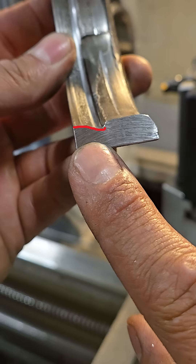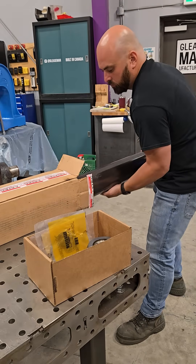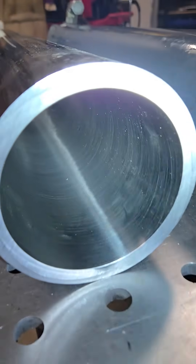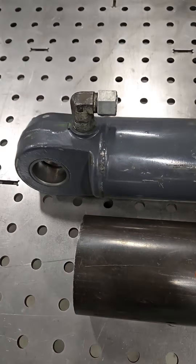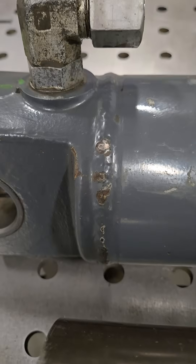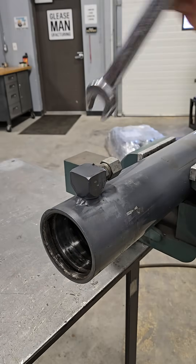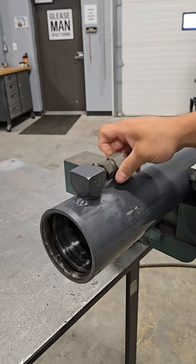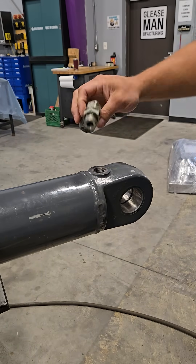What we have on this cylinder that we're working on is that ramp in and then a ramp out — and that's bad. No need to stress because I have the fix for it. You can buy one of these cylinders right off the shelf ready to go. I'm gonna have this guy back on the road in no time. The only problem is there is some assembly required, and that's exactly what this video is about. So this is the re-barreling of a hydraulic cylinder, and in case you're wondering, this came off of a big John Deere excavator.